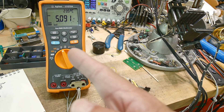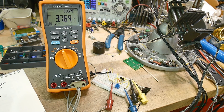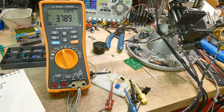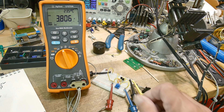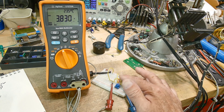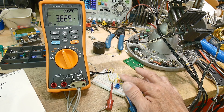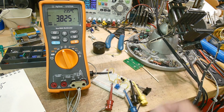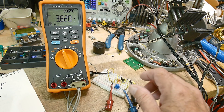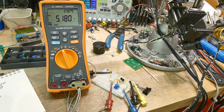I've got five volts. Now I'm going to add the load and you can see the voltage dropped. That's because these transistors are dropping a little voltage under current. If you go and touch these transistors — whoa, that one's getting hot! I can't leave my finger on it, it's too hot. Alright, let's disconnect the load.